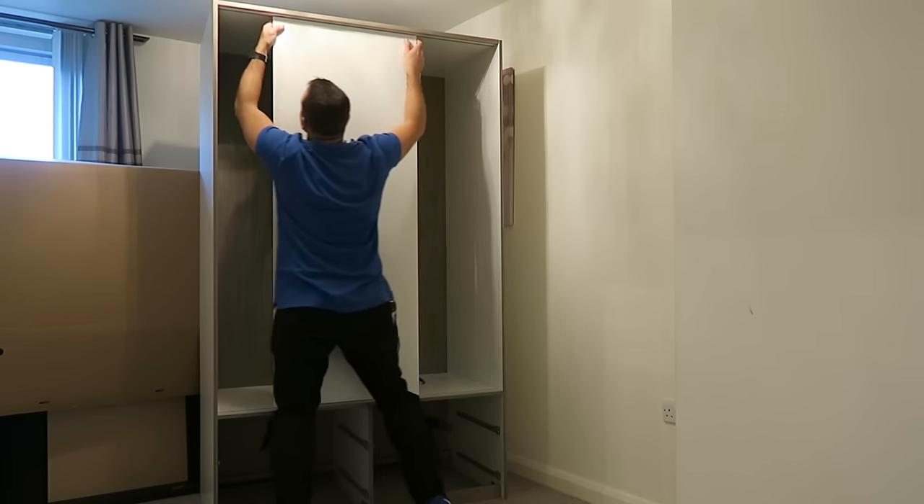Place them in on the front panel — tap in one side and then the other. Secure the locks — there are two plastic locks on each side; just twist the lock and secure the side panels. Bottom panel for the drawer: we're going to have four drawers so four bottom panels, and these are the back panels. Place them in and secure with two plastic plaques on each side — four plastic plaques for each drawer. Just place them in and hammer it down; make sure they're lining up nicely once you finish.